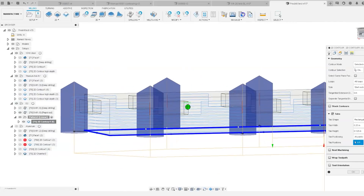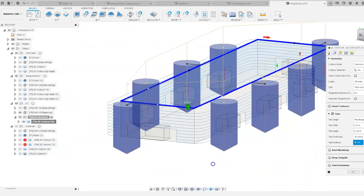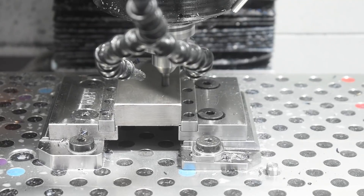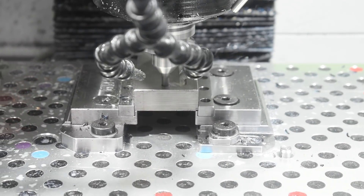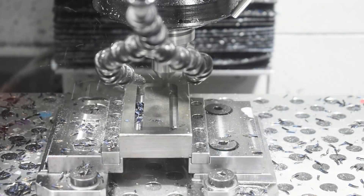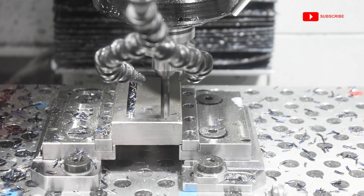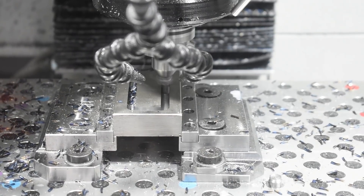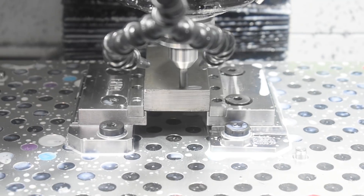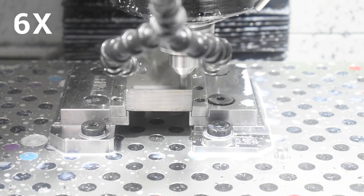Simulations are great but let's see what happens in real life. The first piece of material I grabbed was a chunk of 1018 steel and as I soon found out that was a little too soft — this Tormach 1100 MX pretty much just mowed through it. I plunged down half an inch straight, no problem. I spent the day just slotting as much as possible just to see what kind of angle I could get out of the tool and what would happen.